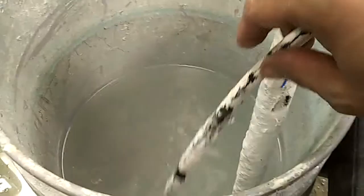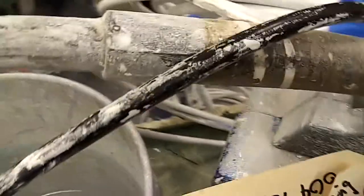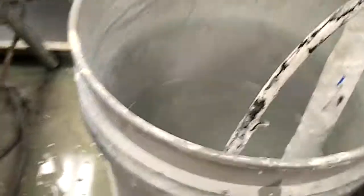We're going to learn how to prime a machine properly, because a lot of guys don't know what priming means. Priming to them usually means it's finally picking up fluid, but it means much more than that. What it means is to get everything within these lines out of it — the return line and the hose line. That means the air, previous fluid, water. Priming means to get everything ready, like you're priming your brain for a subject — you're reading ahead.